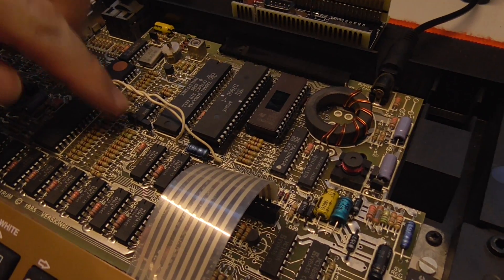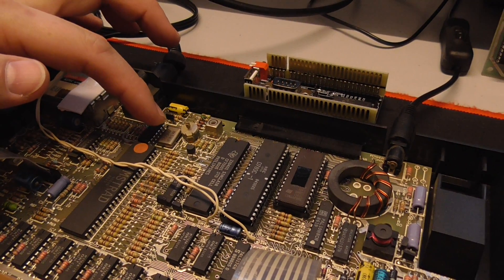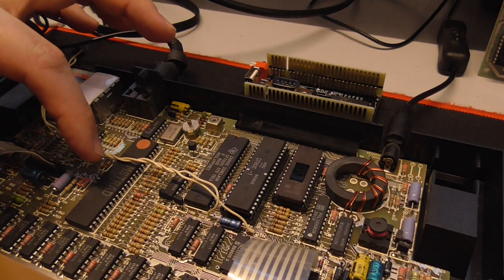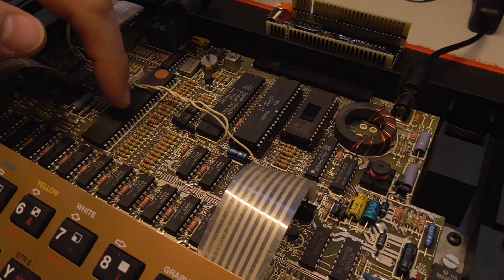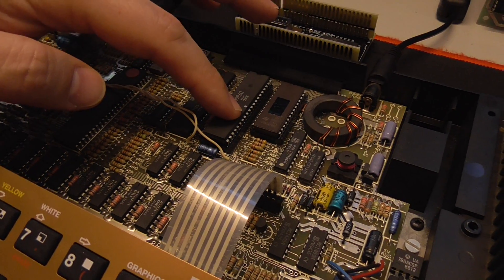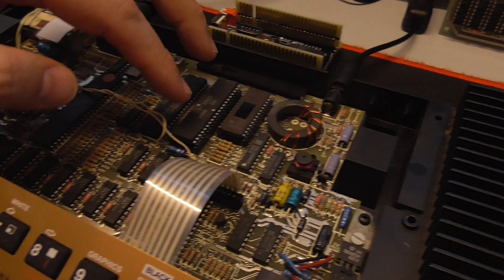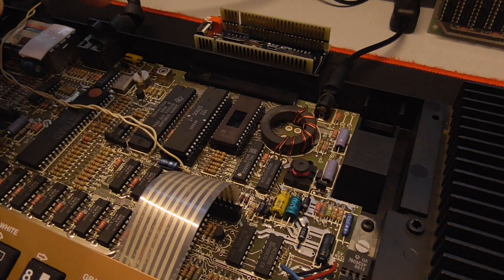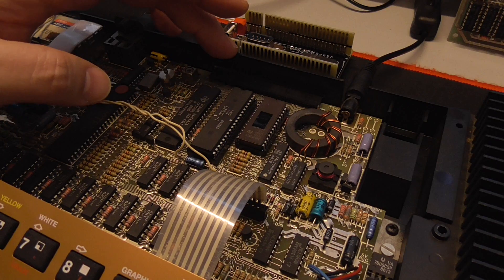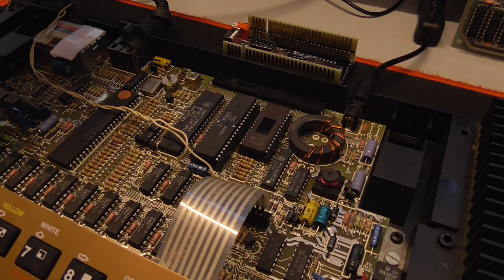There's a similar clock circuit creating 17 MHz going into the ULA chip, and then the clock signal coming out of the ULA chip - you can call it buffered - is sent to the Z80 CPU. The buffering done by this transistor is enough for the Z80 CPU, but everyone knows that the clock signal on the edge connector of the Toastrack is very unreliable and weak, and only peaks at about two volts or something.